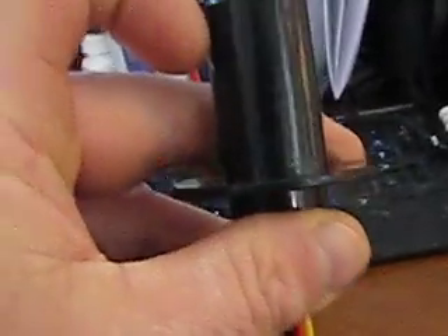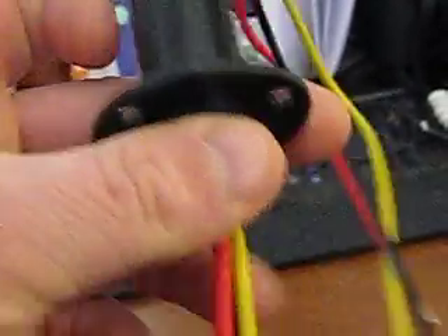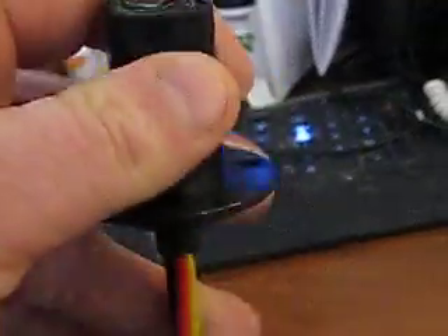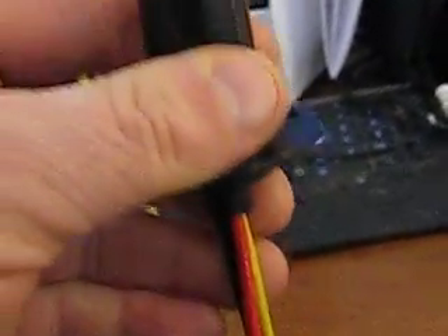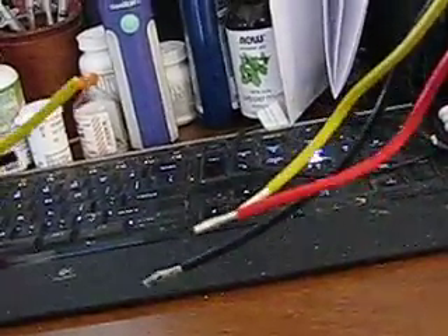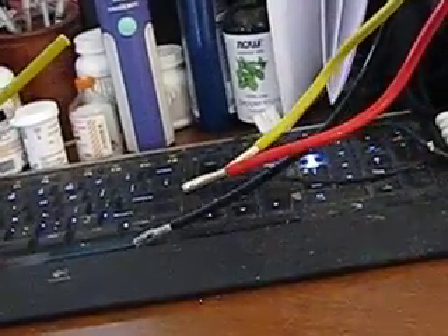You can use tapping screws or however you wish to do it. It's 12-gauge wire, so it will be good for most turbines out there that I know of. The other end attaches to your down leads — I've been using an outdoor extension cord, but you can buy cable at the supply house. You want to use multi-strand, not solid wire. This is multi-strand, for the wild AC that will come out of it.